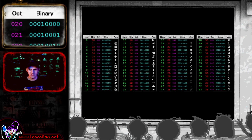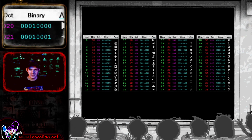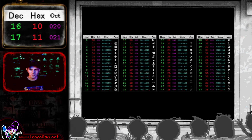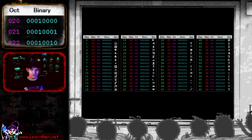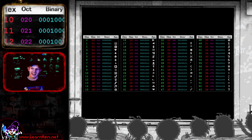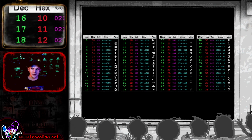And if you look at the bit combination, you will see that the 4 bits on the left of that binary number define the top digit, and the bottom 4 bits define the bottom digit. And 4 bits is referred to as a nibble, which is a joke because 8 bits is called a byte and half a byte is called a nibble. Ha ha, very funny. So that's how hexadecimal, binary and decimal map together.